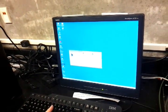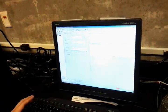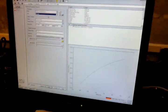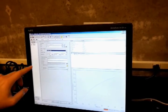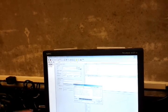Go to the computer — open TA Instruments Explorer, then DMA Q800. This is for these machines. Here is the experiment setup. We use the DMA control force — you can choose different methods, but right now we use control force. The clamps setting is for tension films, and the sample shape is rectangular. You'll enter the length, width, and thickness, and add your sample name, then press to save your file to a certain folder.